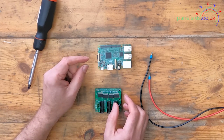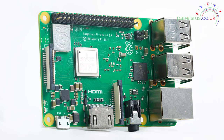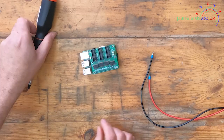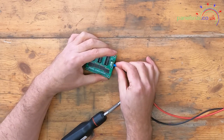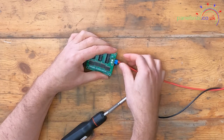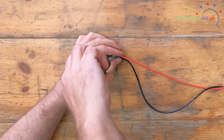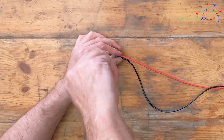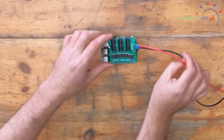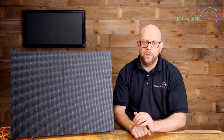It has the silver case with the Pi logo on it — the Pi 4 and 3B Plus have a different arrangement. We'll just fit the hat on top — there we go, that's sat on top. We can now connect up the power to it: V minus ground and V plus five volts, and they both sit in there nicely. So that's power sorted — power's coming in from the Mean Well and driving the hat and the Raspberry Pi underneath it.